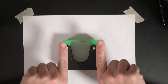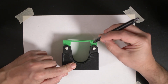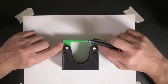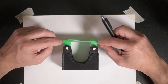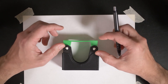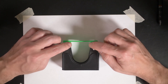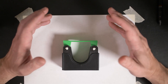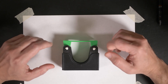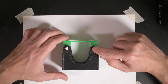These thickened portions poking off are called the arms. The arms have two springs: the main springs on the inside, and the front springs on the outside. These edges are basically acting as springs — internally we have three walls printed, which provide much more force than the hollow infill in between, which is why I differentiate between the main spring and the front spring. The whole arm as a unit is kind of a spring with an inner and outer face. This flat portion across the middle I'm calling the hammock. And of course we have the two pivot points and the fork.